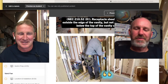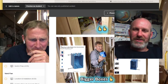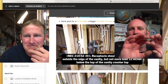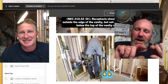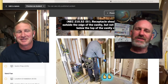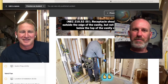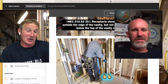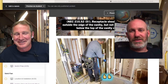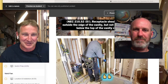That box setup with the two-by-four for the outlet — there's a much easier way to do that. They sell a metal bracket that spans across two studs and holds the box wherever you want it, positioned anywhere on the bracket. A lot easier than doing all that framing for an outlet. On an outside wall, that kind of work hurts your R-value too, so the metal bracket would be better for everyone. Especially with the plumbing there, it would be a lot easier.